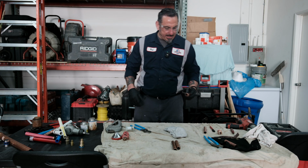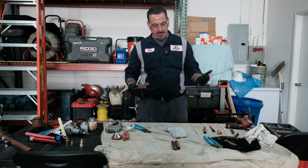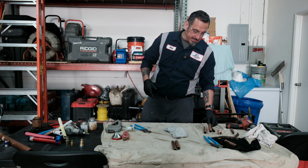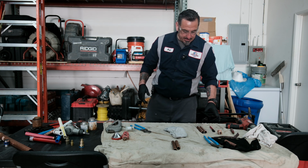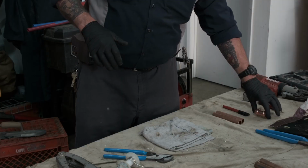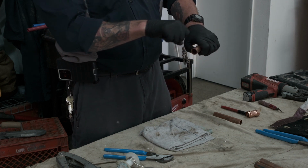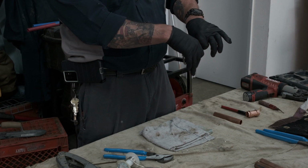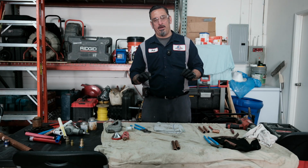Okay, so like we had mentioned to you about the type of copper pipes and the type of copper soldering application, here's another application that is used very often in the industry, and it's very fantastic. You can't stop the water flow or dripping when you're soldering. Now there's different tools you could do by putting a jet sweat plug, maybe a ball valve or union, but with the ProPress, you don't need to worry about the water running in the pipe.